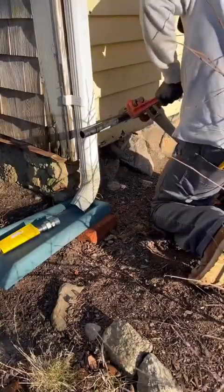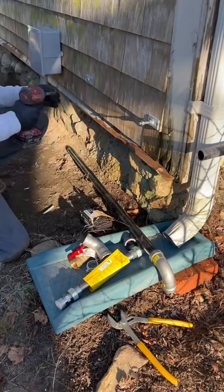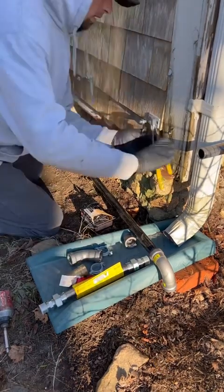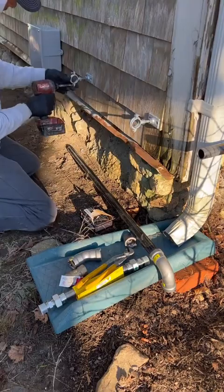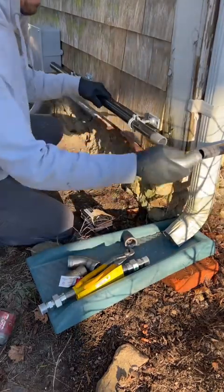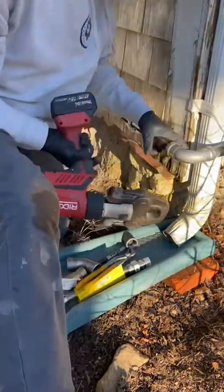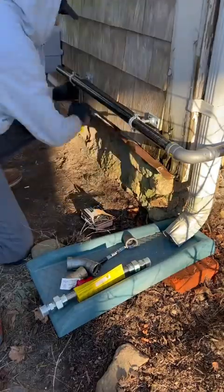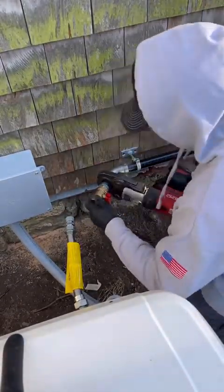Yes, what you see is black steel pipe on the outside of the house. Whatever's not going to make it on the test I'm going to paint gray, and whatever is on the test I'm going to paint the pipe gray but leave the fittings exposed until inspection. If you paint the whole thing, the inspector's going to think you don't have a leak because you painted all the joints. Leave the joints exposed, get the inspection — that way when I go back I just gotta paint the fittings.